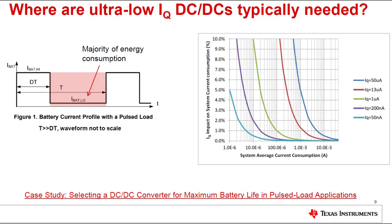Especially when you have devices that wake up once a day or once an hour, take a measurement, transmit it, and go back to sleep — the quiescent current becomes the dominant power usage. Even though it's extremely low, the amount of time you're spending in that low power mode is so long that the quiescent current really starts to matter, even though it's so low compared to the running current. Maybe it's three orders of magnitude less, but it's three orders of magnitude longer. So for wireless — or what they call pulse load applications — the quiescent is important.